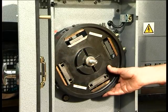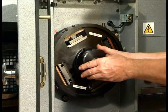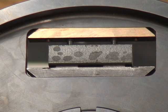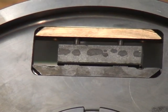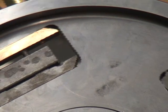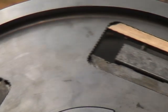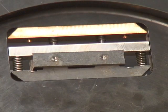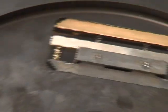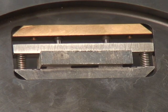It is possible to have a fixture set up with two specimens in first and second cut pockets and two specimens in third and fourth cut pockets. To speed up production, additional fixtures can be purchased. For example, a fixture can have four specimens in first and second pockets, and a second fixture can have four specimens in third and fourth pockets. Whilst one fixture is being machined, the other fixture can be unloaded and loaded, so there is no lost time for clamping the specimens into the fixture.